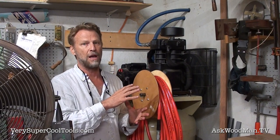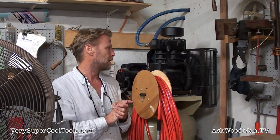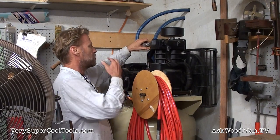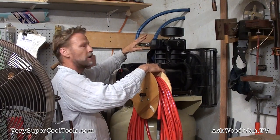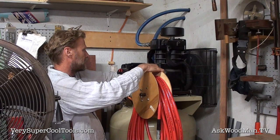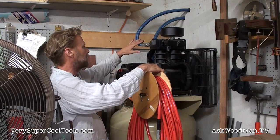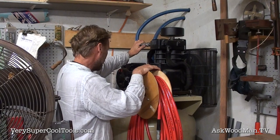The tools feel cool to the touch no matter how hot it is, and this is August in Texas — high temperature, high humidity — so it's the most stressful time for trying to take water out of a compressed air system. When this is going, it's 250 degrees, but I can put my hand right here on the downside and I can just touch it because I've interrupted that system — but I'll show you that in a close up. So let me go ahead and drain this and see what we get out of here.